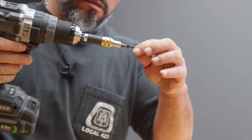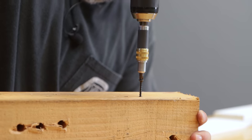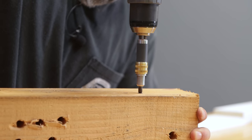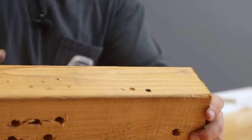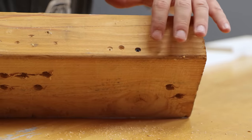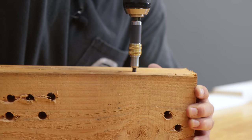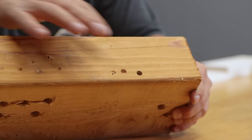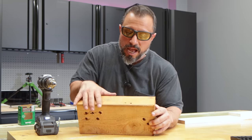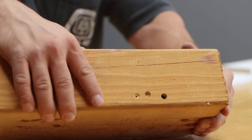How's the magnet? Look at the magnetism and the fit — that's really nice. Then you just drive your screw. For demonstration purposes I did go a little deep. You might be drilling a hole for a plug; at that point, depending on your fastener and what you're doing, you put a dowel in there, cut it off, sand it down. You already have pre-made plugs, but you can see you have some versatility. I really like the way those bits grab.